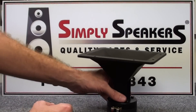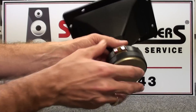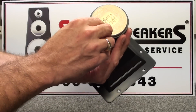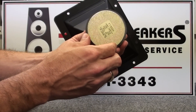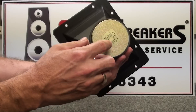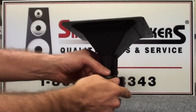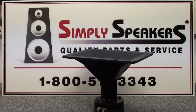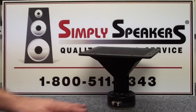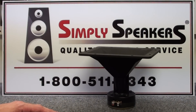This unit is ready to go. You'll notice it already has a red marking for the positive connection. On the bottom there's a plus and minus marked on the sticker. Sometimes you'll see Foster or Fostex units without any sticker indication on the back — that's okay, the positive side is already marked for reinstallation into the cabinet. This driver model may be listed as H025, H025 N27, or N30 — all very common models that all require the same diaphragm.